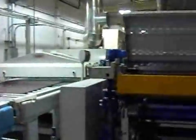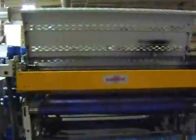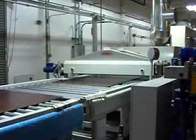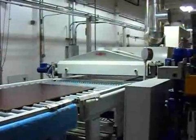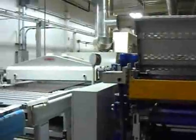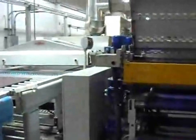This is where our staining station is, and currently we do not have the stain machine installed in the line — we just have a bypass conveyor. So when we're not staining, we can just pull it offline to clean it, service it, or set it up for another run. The bypass conveyor then just slides out of the way when we need to run the stain machine.